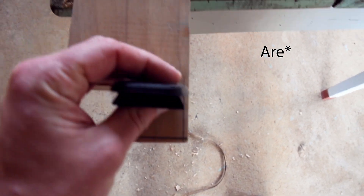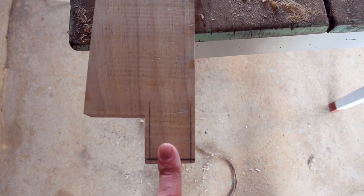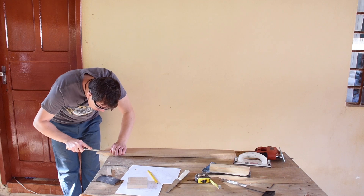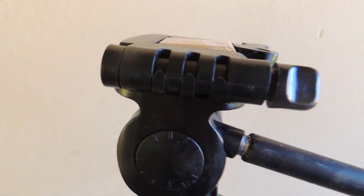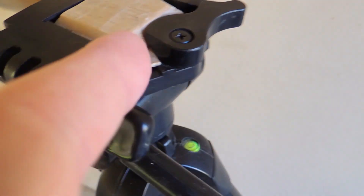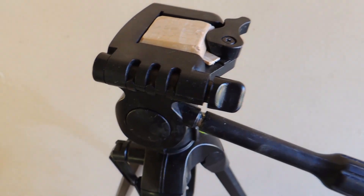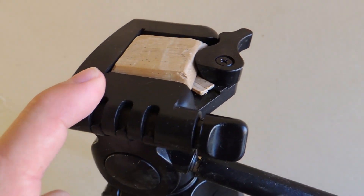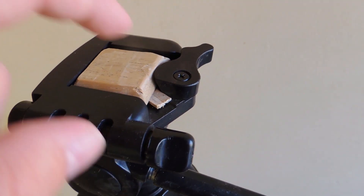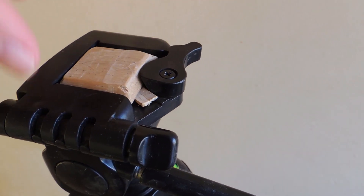This line is to make those angles, and for that I can use a chisel, or I can tilt my jigsaw for almost 30 degrees. I just finished this piece. Be sure it's level when you're testing and reducing its size. I use this little piece of wood to let it rise a little bit, because when it's glued to the base, the base will sit on that part of the tripod. So if this is a little bit shorter, it's barely entering the tripod, and when glued to the base, it will not fit anymore.